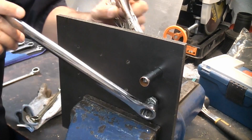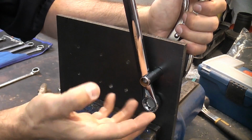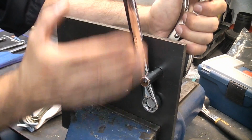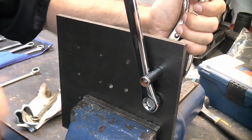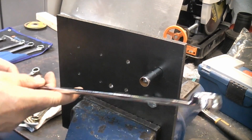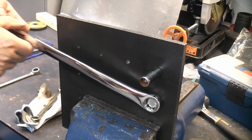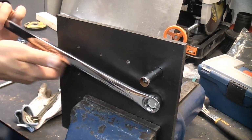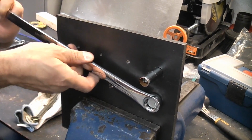But with the aviation spanners, because they are straight, you can lock them up perfectly well on something like that or against a flat surface, and there is less chance of the spanner slipping off. So that makes them really useful for me. Obviously that may be a disadvantage for some people. It does mean that when you are tightening nuts and bolts, there is potentially a trapping hazard, and some people do call straight spanners like this knuckle breakers.